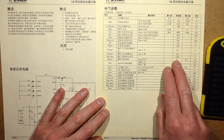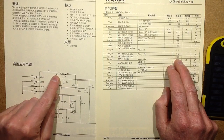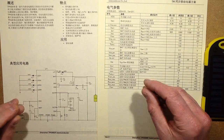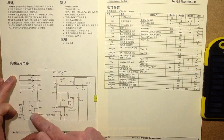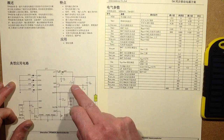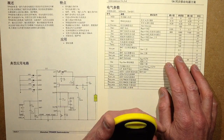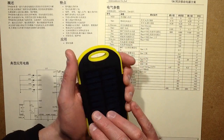On the lower end of the scale, it says VBAT end 2.85 volts - that's presumably the point it's going to cut off. I wonder if it cuts off the LED flashlight at the same time or just cuts off the boost converter. It possibly has the behaviour that if you plugged something like an LED directly into the USB output, even though it switched off the boost converter, I don't know if there's any chance it would trickle current through the 2.2 microhenry choke to the output and discharge below that voltage. It also states another voltage of 3 volts - I'm not sure if that's the point it will re-enable once charged back above 3 volts. The quiescent current of the chip is about 15 to 25 microamps.